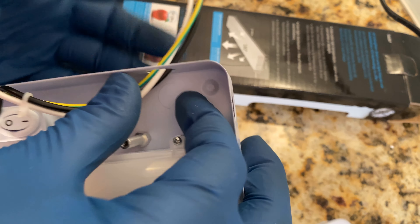The cover plate will be installed like this, with the wires entering under the cabinet. I need to remove a knockout so I can install it correctly. I'd like to mount the wires so they're not visible — I'm going to wrap the wires and connect it. First I need to drill a hole there, and the next step is to get a hole somewhere in the middle. I think that's a sufficient hole.